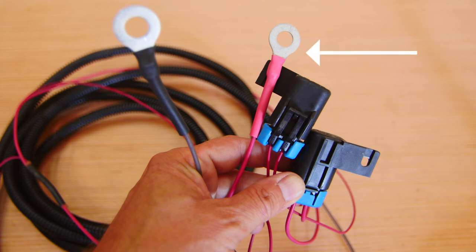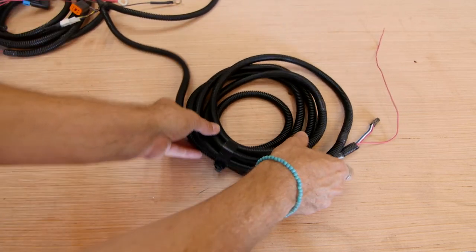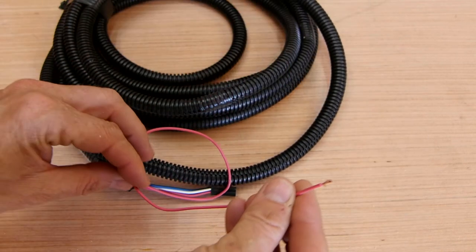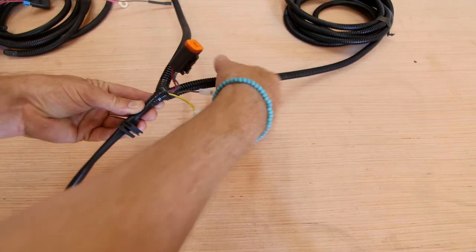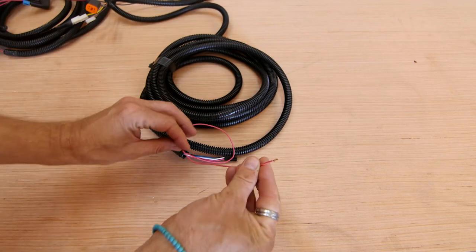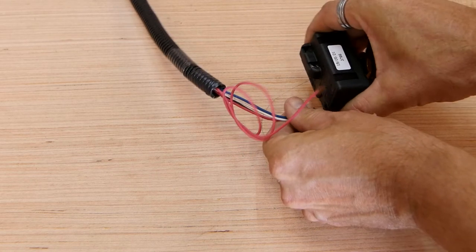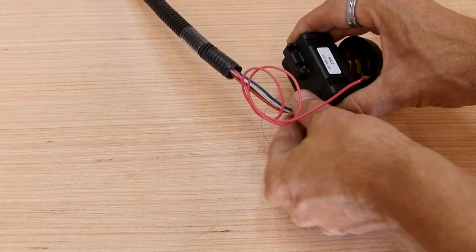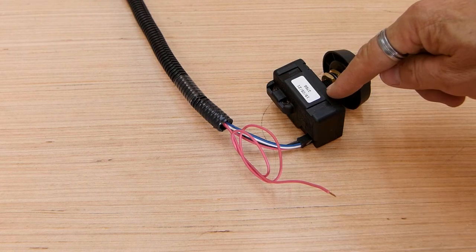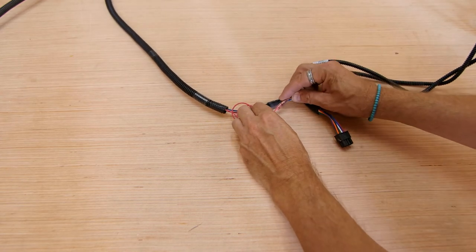At the split, one leg of the harness is for the power supply — it has positive and negative supply cables with ring terminals. The brown wire is the negative and the red wires are the positive. The positive wire actually has two fuse holders wired into it for circuit protection — one for the controller and one for the heater itself. Just beyond those fuses those wires combine into one ring terminal connection. The other leg is for the controller — it has a black connector with four wires and a red wire with just a bare end. This leg should be routed to where you want the controller, typically on the wall. The black connector plugs right into the back of the rheostat controller, and when using the rheostat controller the red wire is not used at all. This controller leg of the harness is 165 inches.